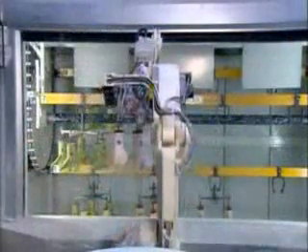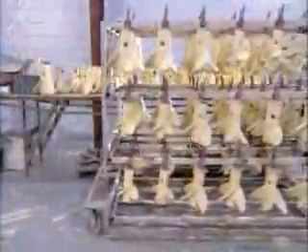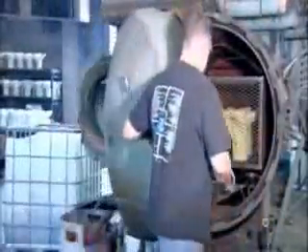Then they dry in a room with a system of fans. The process of dipping and sand-bathing builds up a hard ceramic shell around the wax. They load the propellers into a pressurized oven called an autoclave, where the wax melts away, leaving only the ceramic shells.